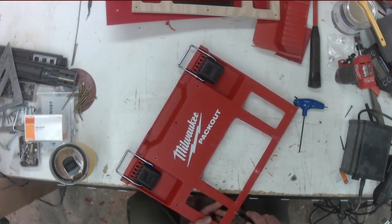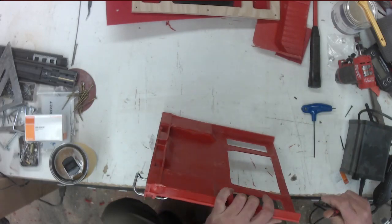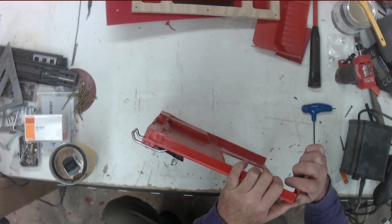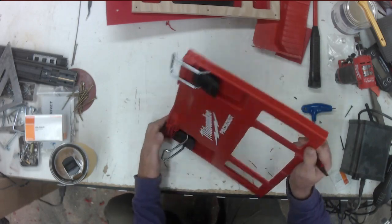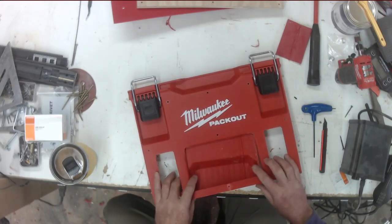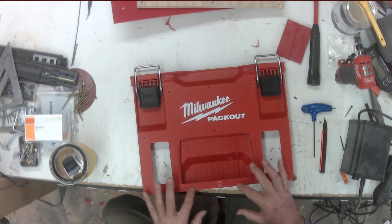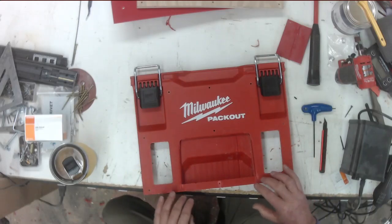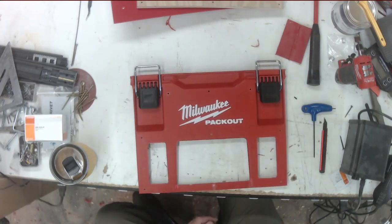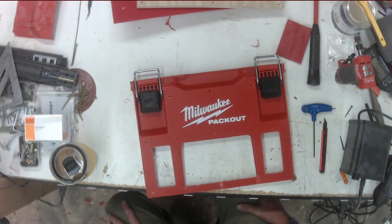I definitely feel that the plastic welding is one of the coolest things I learned from doing this project. Because as you can see, this was the piece that was cut out of the front of the drawer, right in there. And so this didn't exist until I took some of the cutout pieces from here and welded them together, and then also welded them to the front panel of the box. And what that did is it gave me a bolting location here, right in the center, that wouldn't compress.